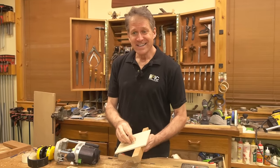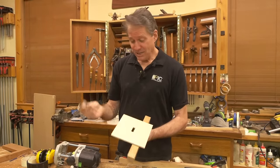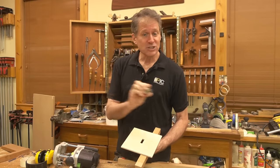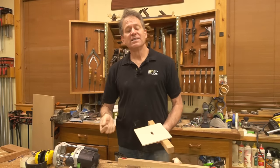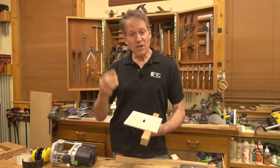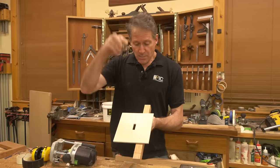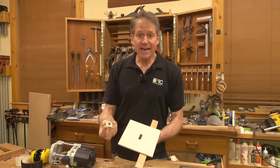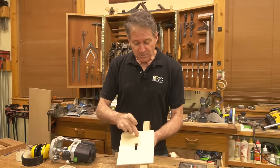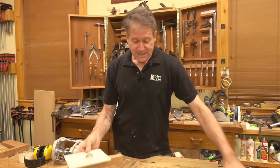One way you could make these slots is to simply take a half-inch router bit with a straight edge, plunge, and make a slot. Then that half-inch slot becomes the guide for your collar while running a three-eighths bit. This is a technique we used extensively on the Adirondack chair project — we made a curved groove in the template for the seat slats, first making the template with a five-eighths slot, then running a half-inch collar in there. We also plunge-routed for the tenons. But I want to show you another way: rather than plunging and making a groove, you can rip some strips and create that gap. It's so easy — it just takes a little bit of gluing.